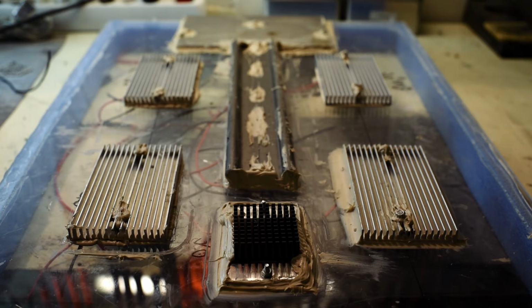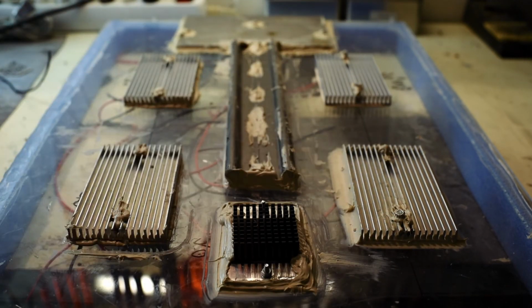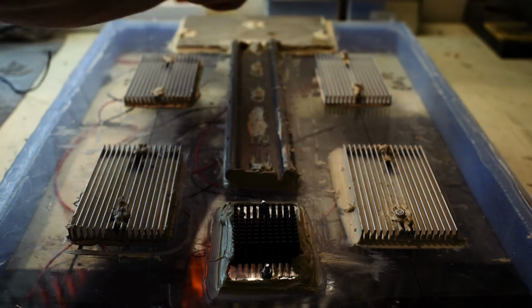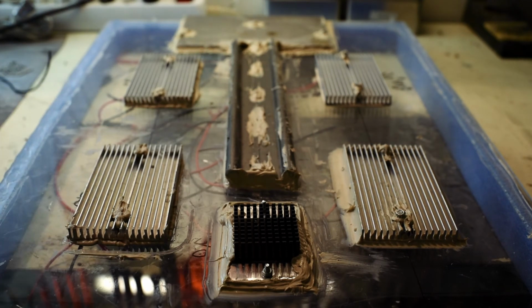I'm thinking running them at half power, so 2 of them in series to, let's say, 1 battery, but it'll be a bank of batteries. So I series, and series, and series, and then I run those in parallel to give each Peltier device round about 8, 7, 6.5 volts at a lot of current, as much as they need. They can draw up to 4 amps, but I think that's a lot. And then we can see how much they cool and how much power they draw.